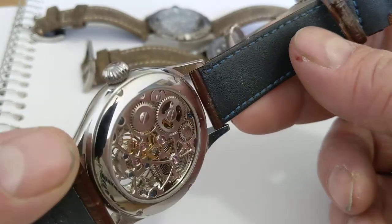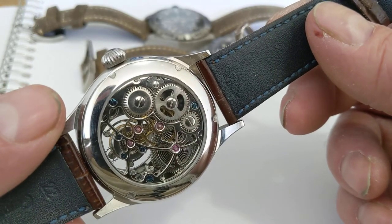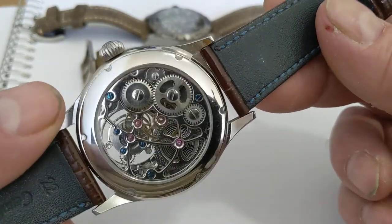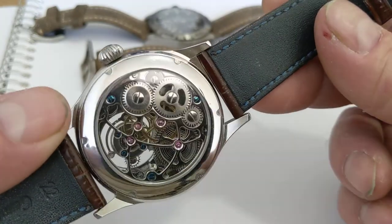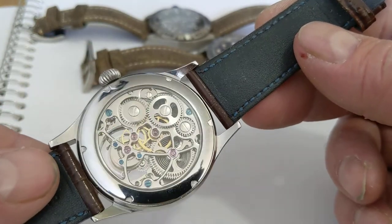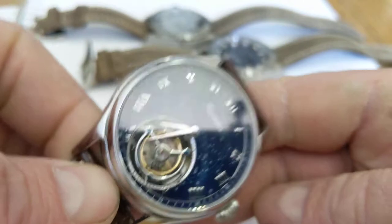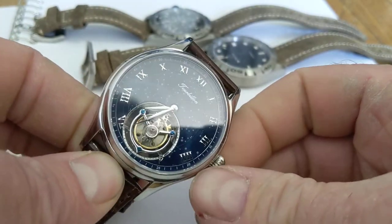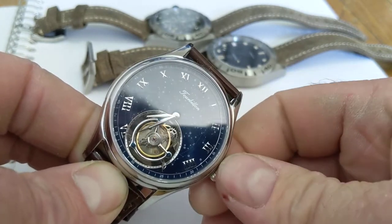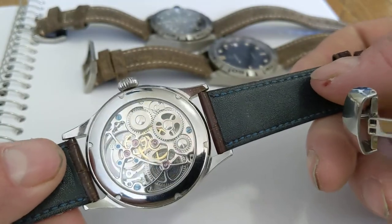The basic Chinese do it too. But this one - what they've done is they've probably mass-polished it, which in the industry means you throw them in a big bin with a vibration tumbler and just polish everything up. It's not haute horlogerie, but it looks good. I also noticed there is a Unitas-style click, so I'm wondering if they're using a core of a Unitas 6497 clone as the basis of their parts, and then put their own tourbillon in. This is a very nice tourbillon - I think it's better than the Seagull tourbillons. At $600 it looks good.